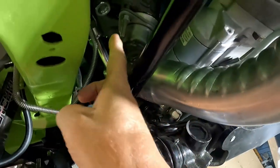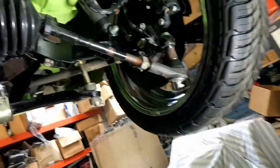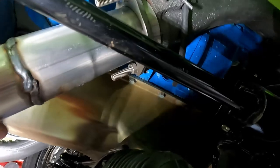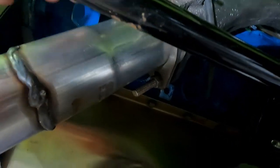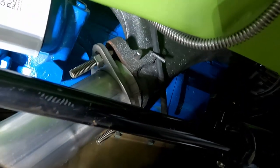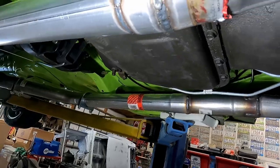Big bolts, had to get some bigger bolts to put in there, they didn't have enough threads for the gasket to squish the gasket down. And your exhaust manifolds had been drilled out. Yeah, the exhaust manifolds had been drilled out to where you couldn't drive a stud up in there. And then just put a nut on some of these studs sticking out. So it's a complete bolt going through, which, you know, that's not that big a deal. But got my oil filter on. And this, like I say, is all solid.